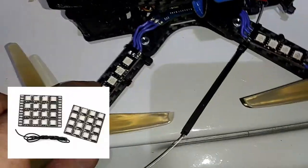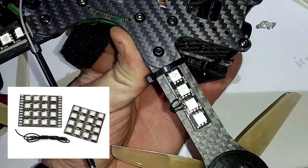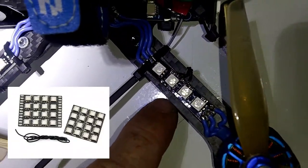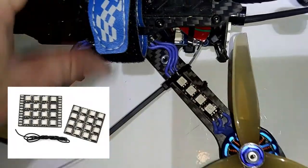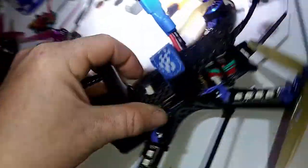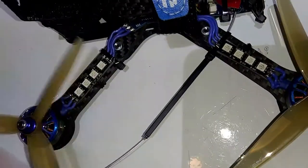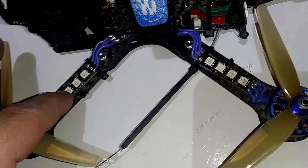I've got Tinys LEDs on here, and I get these from GetFPV.com - that's the one thing I didn't get from Amazon, and you can't get them from Amazon. Great LEDs. You get the bottom and the top in a set. You set the LED color using little solder spots at the top - there are multiple colors you can do. I got these set for blue. Then you run tiny discrete wires to the other side and set that color too. They're my favorite LEDs, but they're constantly out of stock.